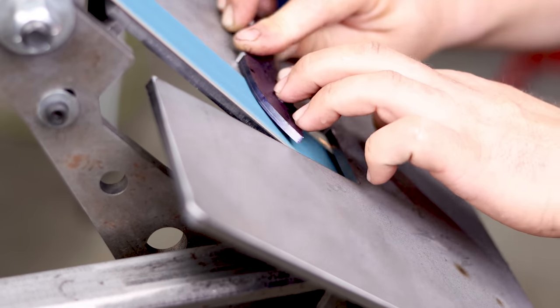You just saw Brian put together the True Tilt and then saw me demo using it. The beautiful thing about the True Tilt is you get a quick, consistent bevel grind each time. You also get feedback every time you're grinding — you get to feel the heat from the blade post-heat treat so you're not overheating that blade. That's what I found is the downside of a bevel grinding jig: they're great, but you don't get the feedback of feeling how hard you're pushing and you don't get the temperature feedback.